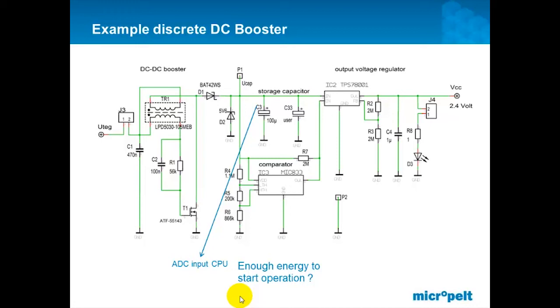So in certain applications, to avoid any failure in the transmission, we measure that voltage, guide that to an ADC of the microcontroller, and say, I'm sorry, I can't take action for you, dear host, dear receiver, because I simply don't have the energy. Or you make a kind of adaptive duty cycle. You simply wait until you have enough energy. So either we send back an acknowledge, I'm very sorry, or you do a kind of mini sequence, not the full test. It's a trick that we always do in an application where a capacitor is used.